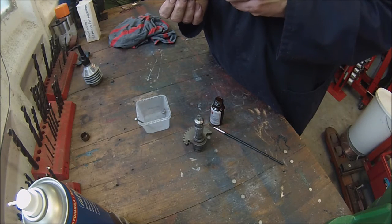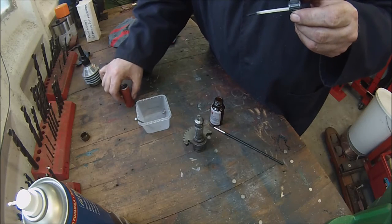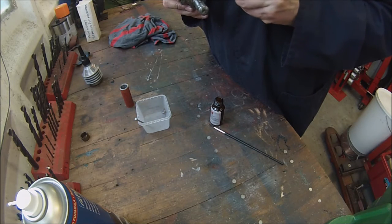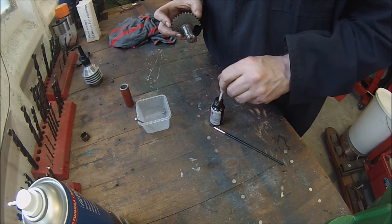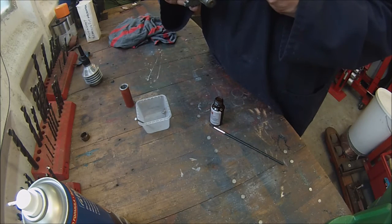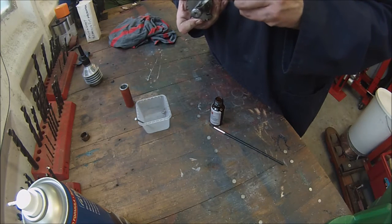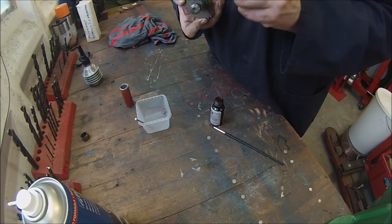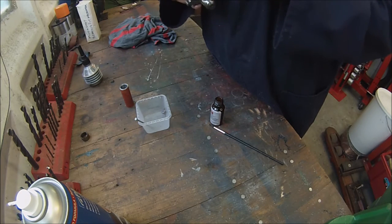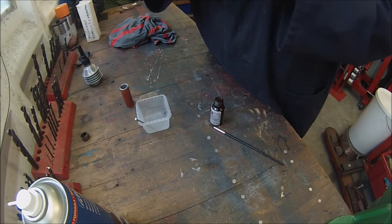We coat both the surfaces with the activator and give it a few moments to evaporate. With the Loctite one, I think there's a 7-day and a 30-day version. Once you've sprayed it on the metal, providing you assemble that part within the 7 days or 30 days, dependent on the variety, the chemicals in it, which I believe are some kind of copper ion, will activate the Loctite, which is a methyl methacrylate adhesive.